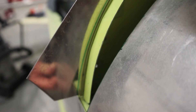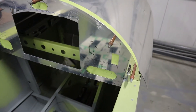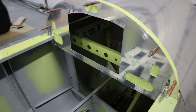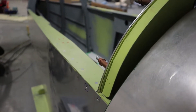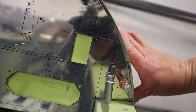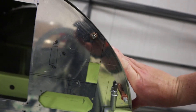Same on the right side. You can see it's going to take up that little gap, which is about an eighth of an inch. There we have it cut, trimmed, nicely filed and sanded down, and it fits nicely. Now we need to cut out the same holes in the sub-panel, keeping in mind there may be fasteners and nut plates to clear, so the holes in the sub-panel might be a little bit larger. There's the final fit — taking up that little gap — and when it's all riveted together later, it'll look nice.